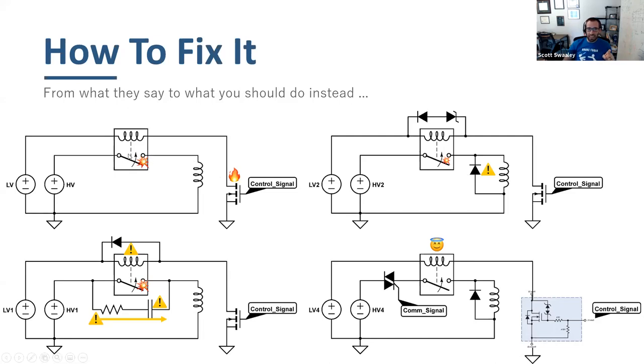There's also the mechanical switch contact that tries to open while connected to an inductor or motor, which will arc. When you look at a relay it'll say on it whether it's horsepower rated for motors, or it'll have separate inductive and resistive load ratings — for example: resistive load 100 amps, inductive load 5 amps. Just make sure you're paying attention to that.